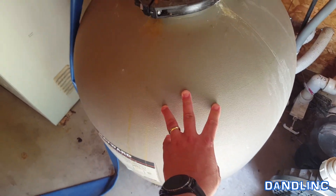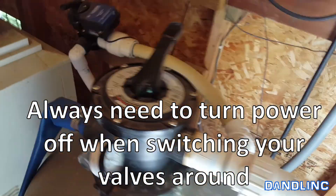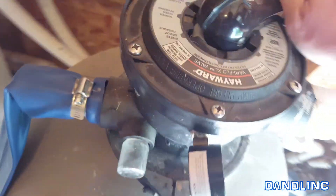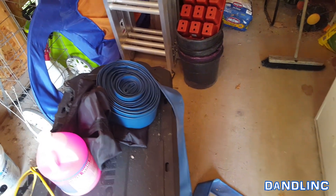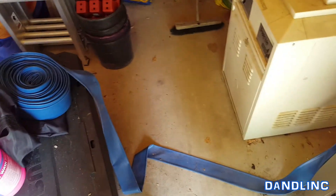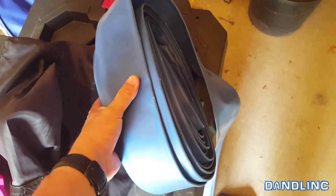The water's trying to push through and it's meeting a lot of resistance. So the way we're going to do this is to close it, turn off the power, then run my valve from the regular filter position to the backwash position. Now instead of going through this hose it'll go through this hose, which we'll run out to our driveway by the culvert. We're going to drain about 100 gallons, and as we do that the water coming out will go from probably a greenish cloudy to clear.